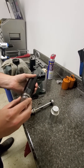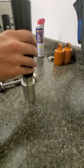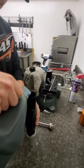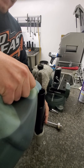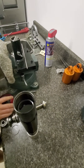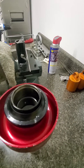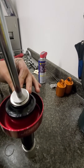We're going to start by putting the divider in — set it, then put it down on the one-inch tall post. Fill the shock with oil. It's not clear to the top, but it's up there enough.